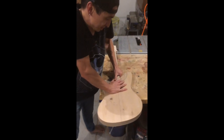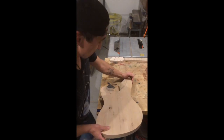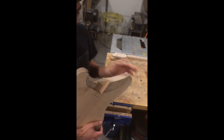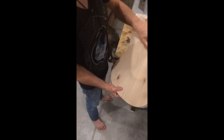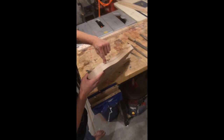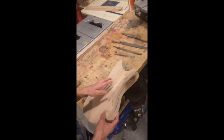I'm going to pop this neck out here — it's in pretty tight. I like my neck to fit nice and tight. So what I do here is I go ahead and take my pencil, and I'll make a nice continuing arch just because that's my style. While I have the neck in place, I'll go ahead and see how the body sits, and lay it out to carve to my body's likings. I like a really deep carve. What I've seen lately in a lot of the groups and forums is: how do I create these carves? The way that I do it is fairly simple.